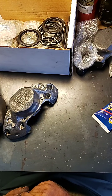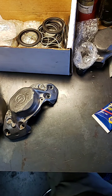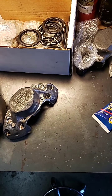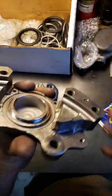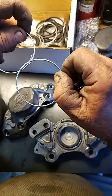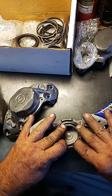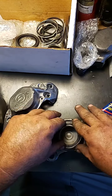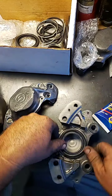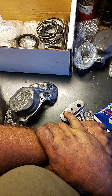That's a tight fit — push that in there a little bit better. There we go, pressed in nice and flat just like that. We then go ahead and put a dust cover on — these are the dust covers and these are the wire retainers. We slide the dust cover right over the piston. Me, I like to put it on after the piston is already in, then push it all the way down.